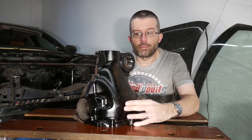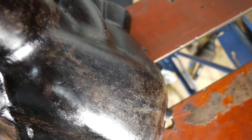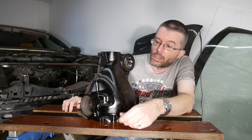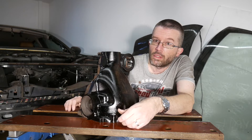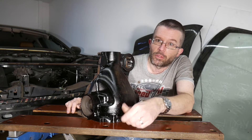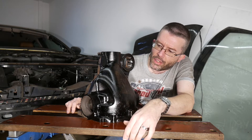And voila! That looks great, but when I came back yesterday I was devastated. As you can see, there are rust particles all over again. This may have resulted from me not allowing the chemicals enough reaction time, not applying enough rust converter, or not spraying on water as recommended. Of course it's only 11 degrees Celsius here in wintertime, so I don't think the temperature was actually the issue.